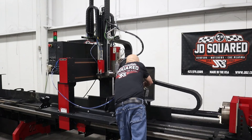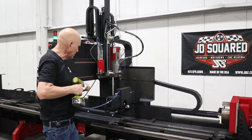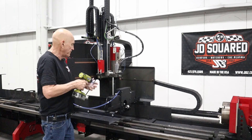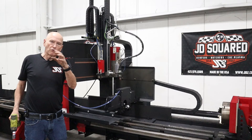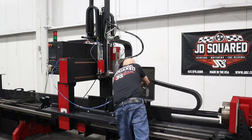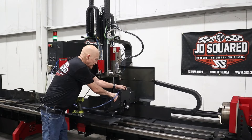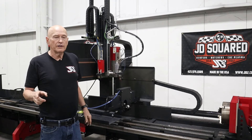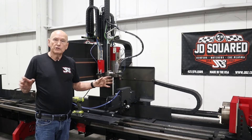So let's go ahead and show you how to do that. Using a 15 millimeter socket, we're going to loosen up those plate bolts — that little square plate I was talking about. Then we're going to switch over to our 19 millimeter or three quarter socket and very lightly loosen up these bolts here. Remember, it wants to tilt. So I ran it out and then used my fingers to bring it back up just a little bit to take the play out. Now the stabilizer is moving — we need to line it up with the chuck.